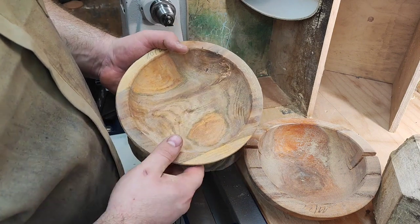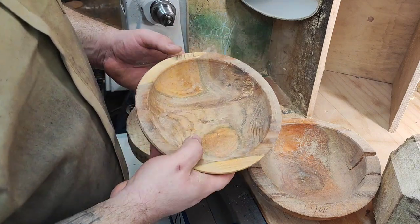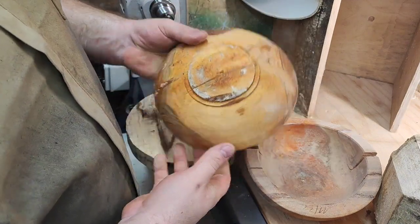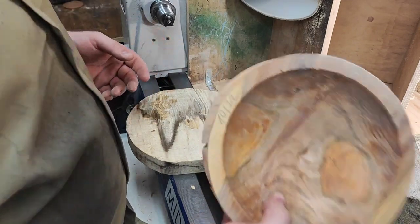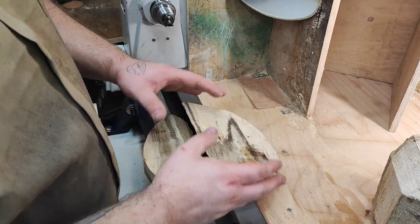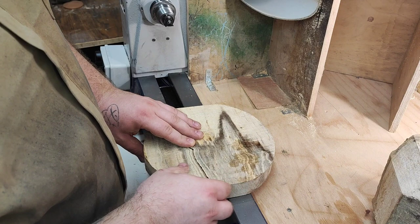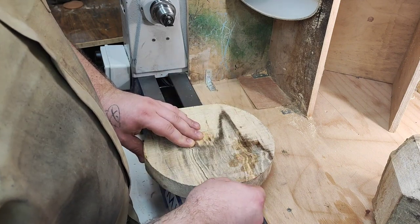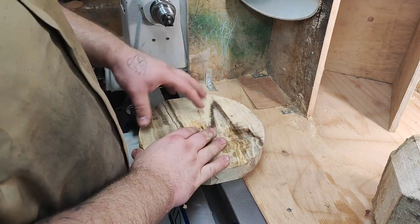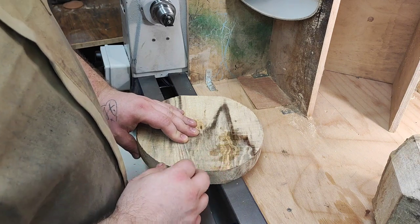You can see there is a big split at the bottom. It doesn't look all that bad from the inside, but when you flip it around it's terrible. Like I said, you might be tempted to put this on the lathe, but just the force of spinning it around can take this apart and hit you in the face — or, God forbid, something even worse. So check your wood. Take thin slivers off the end before you round it over, before you take the final measurements and diameter. Better to take 2-3mm off the end and check for cracks than to risk something like this happening.